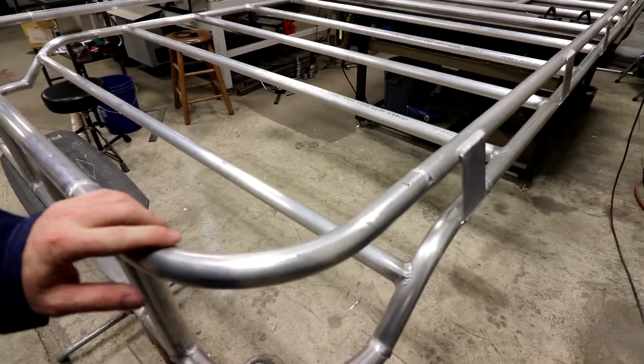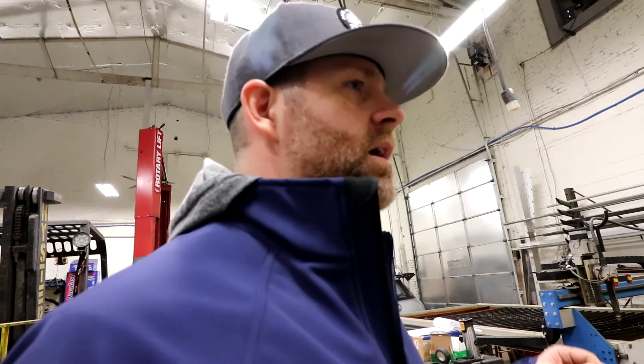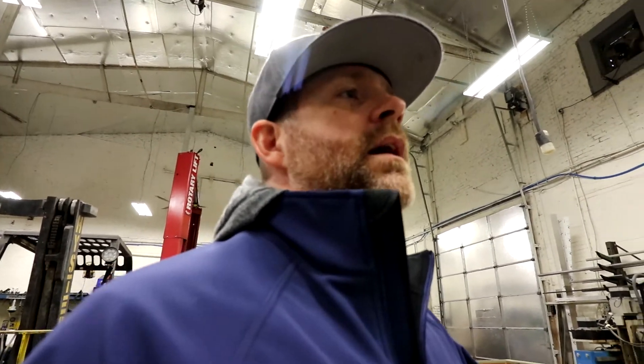The customer will probably show up tomorrow and I probably won't document it. I showed you in my last video how we actually bent this 6061 T6 511 without snapping it — go back and look at that if you're curious, it's a pretty good instructional. If you have some 6061 T6 — which is very common bar or plate — and you need to bend it in a press brake or tube bender, you'll get really good results if you anneal it first by heating it.